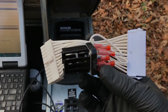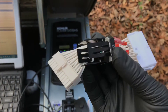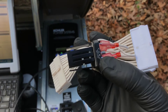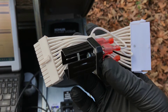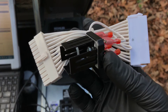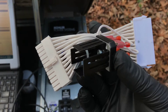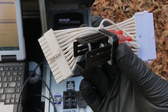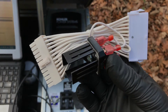The battery charging kit reduces the voltage from 14.1 to a range of 13.2 to 13.6 volts. The relay allows it to turn on and turn off based on the battery voltage, thereby saving the battery and not overcharging it. If you've had one or two battery failures and wondered why the battery keeps going bad, this is going to solve your problem.